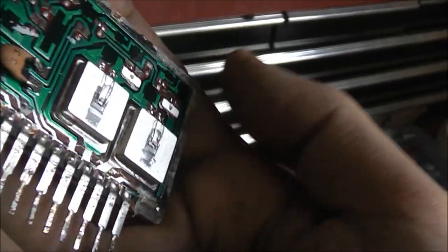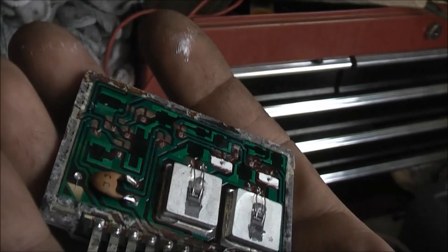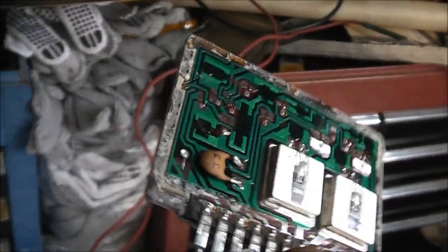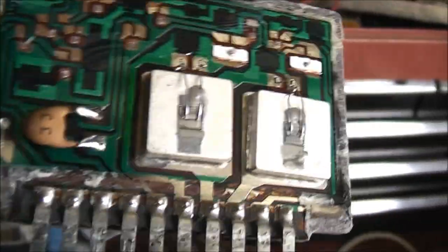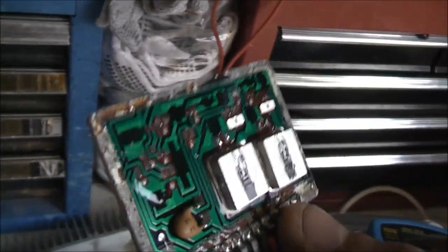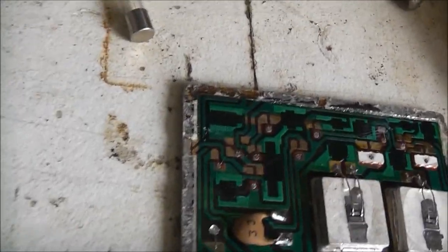So it's inside one of these — you can reverse engineer this and make up your own one with a little tiny circuit board and modern SMD components. This would be a lot smaller. You'd probably get away with just using an ordinary circuit board with a large copper piece for a heat sink, but there's a lot of power dissipated so you'd probably need some sort of separate heat sink.